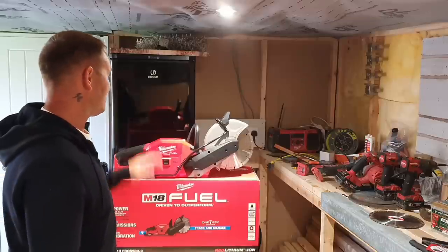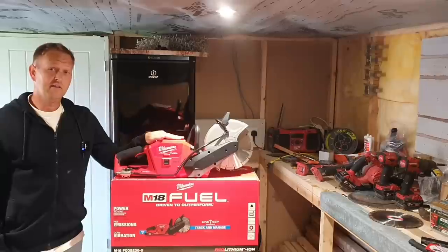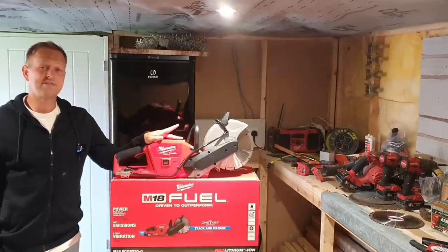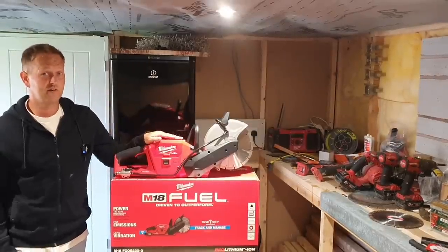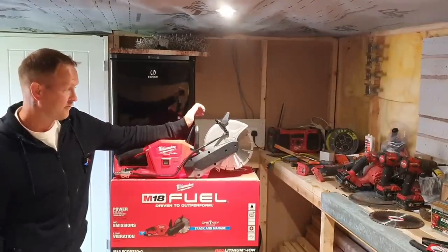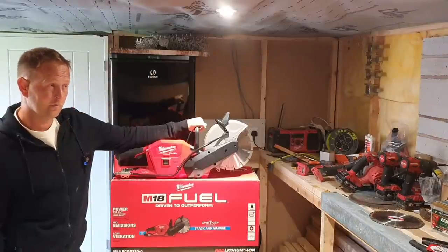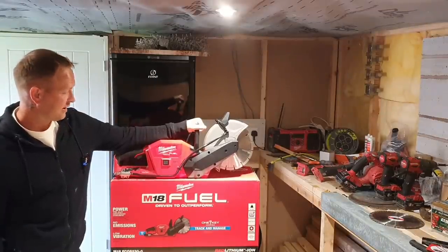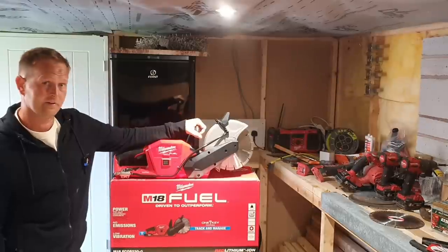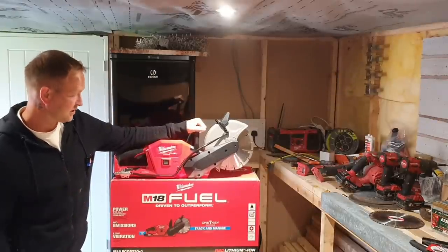Overall for £600 with a blade, that's a good price. It has an 85mm cutting depth, so you'll get nearly through a brick but not quite — same as a Stihl TS410, which doesn't quite get through a full brick either. You'd have to go up to a TS420 with a 350mm blade to get through a full brick, but then the price of the blades and the unit both go up.